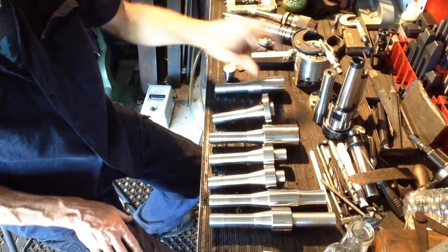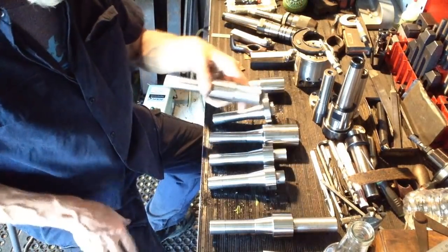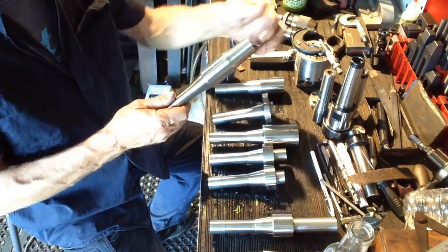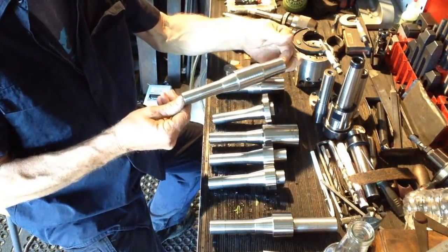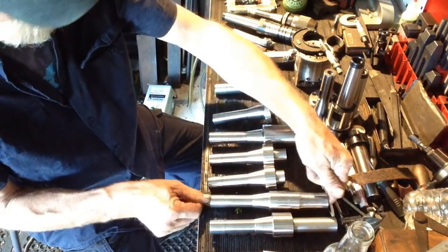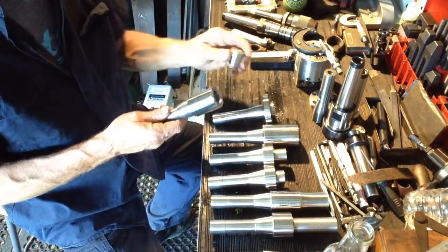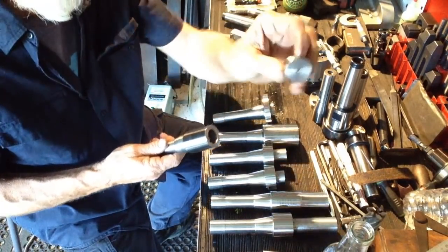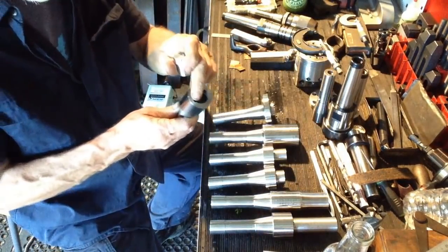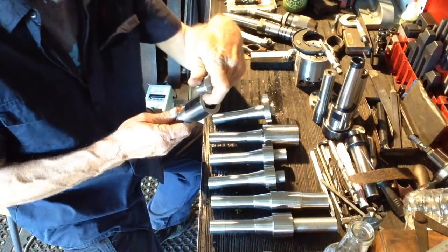Now, when I did the other one, this one here also has a hole through it too, but it has a smaller bore in the end, so we were able to complete this one between centres, so it didn't have the same effect show up. So what we're going to do to counteract this one, I've machined up a little slug with the centre in the end of it, because the bore on this is too big for my centre. My centre just disappears inside.